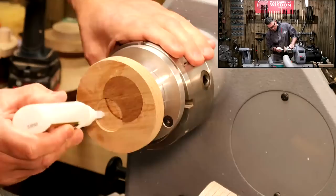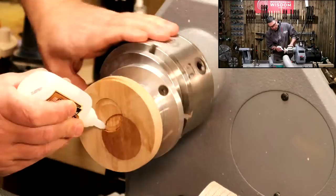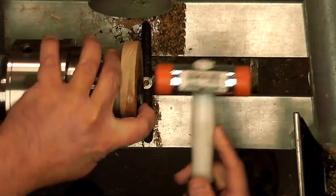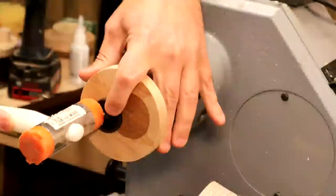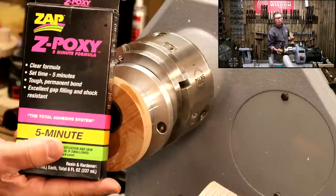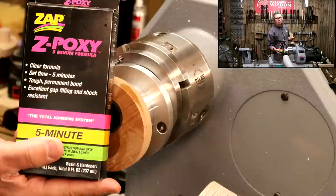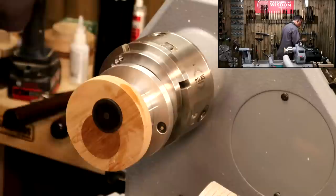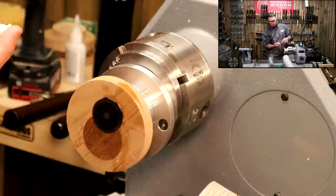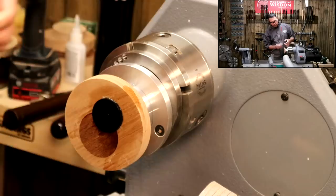That's pretty good — I reckon I'm going to push that in. A bit of glue. Now of course you're not going to be speed-turning at home, so instead of using CA glue you could go for something like an epoxy — a nice five-minute epoxy is a good option. The Z-poxy is a good one: like it says, it takes five minutes to go off and it's quite a hard glue. Going in — squirt a little bit of accelerator on there just to make sure it goes off. Wipe off any excess because you don't want it to spray up when you turn the lathe on.